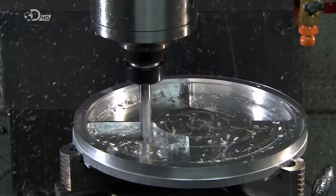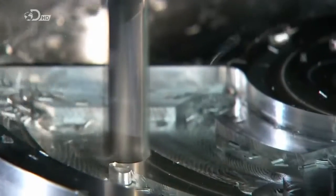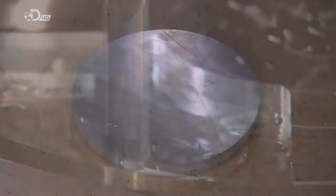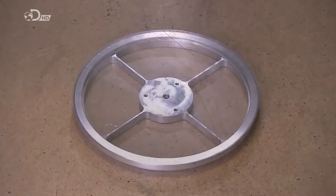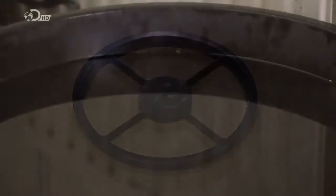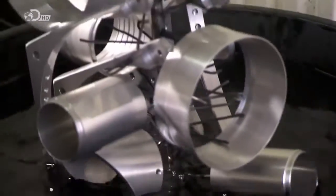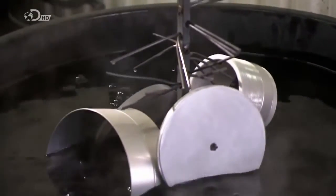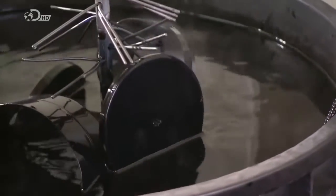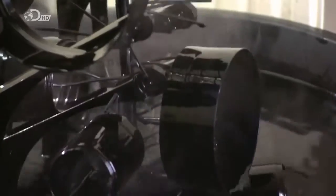More tools transform a solid aluminium disc into a ring with spokes. This part, called the spider, is a framework for supporting the telescope's secondary mirror. After coating the metal parts with a protective oxide, they plunge them into a vat of black dye. The dye soaks into the oxidized pores and seals the surface of the parts.